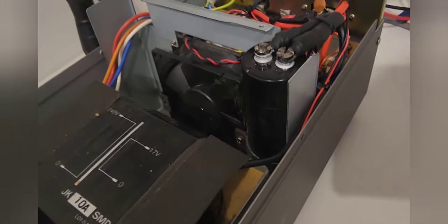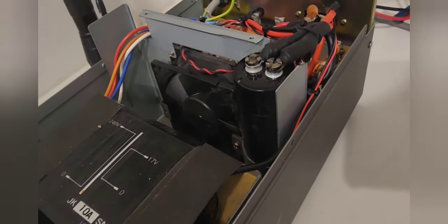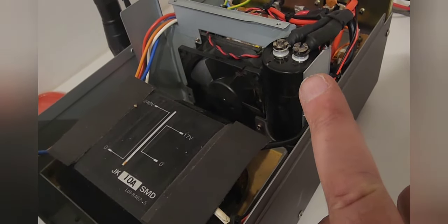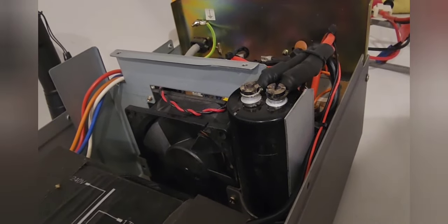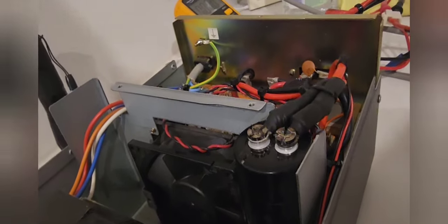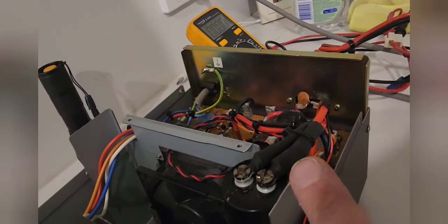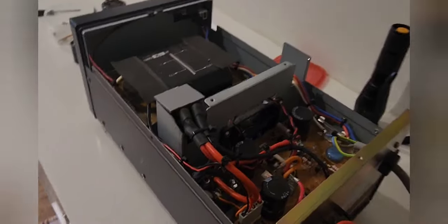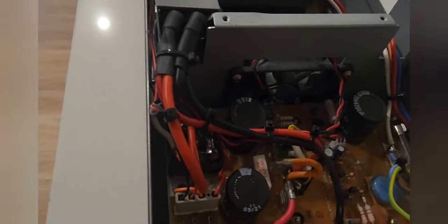In around here you could not see anything — I think I'm the first one to open this up in all the years I've had it. This capacitor is slightly larger than the other by about 10mm, so I ground down the threaded terminals and found my own screws, cut those down in size so they clear the top of the panel. I've used heavy insulation on the lugs underneath and put a cap there which is double-sided — it presents no problems now.